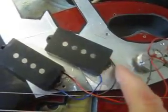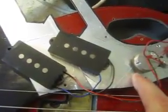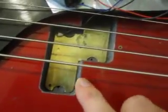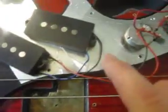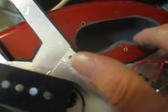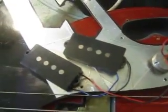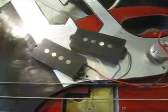And then I shielded the back of the pick guard with aluminum adhesive tape. It works just fine. You don't need copper. What you're trying to do here is create a Faraday cage to keep interference from getting into the pickups. And then I use conductive carbon paint, and I tape it off first, and then I let it come up over the edge just a little bit in several spots so it makes contact with the aluminum foil, and that's what creates the Faraday cage. As you can see, the whole cavity has been painted with it, and it's up over the edge in a few spots down here too, and it works really well. It's quiet when you have the volume up. I don't care what amp you have it plugged into, you turn the volume all the way up, and even fluorescent lights don't really bother it.